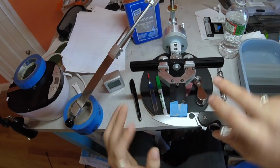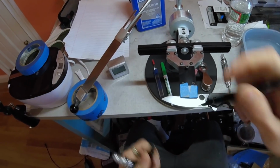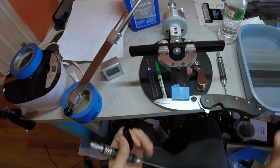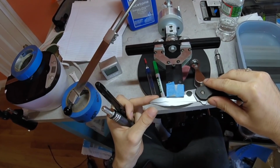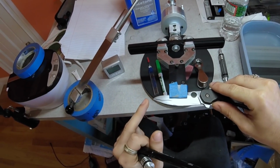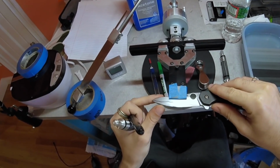So for general purposes, what people will tell you to do is draw a line from heel to tip, close enough, and follow that line, the middle of it, to get your clamping position. A tip given to me recently was to simply line up the tip of your knife somewhere along where the tip of your clamp is. And so that's what I'm going to go by.